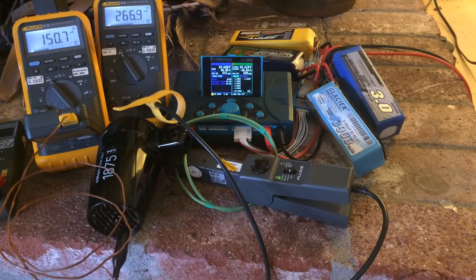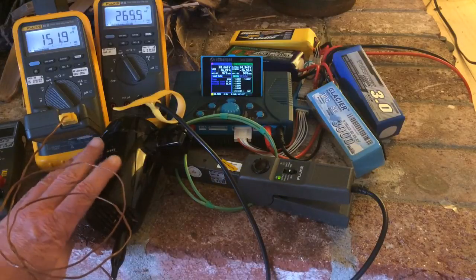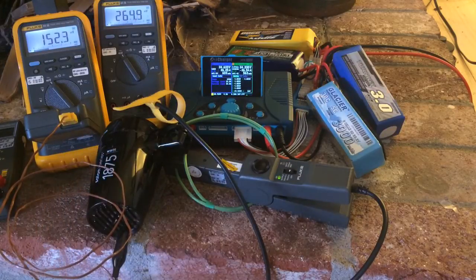Internal temperature is 105 Fahrenheit. On the load side, it's running approximately 24.7 to 24.5 volts and about 26.5 amps. I tested the load resistance on this and it was about 0.98 ohms, which jives with everything we're seeing here. It looks like it's not going beyond 650 watts, so I need to do some more investigation.